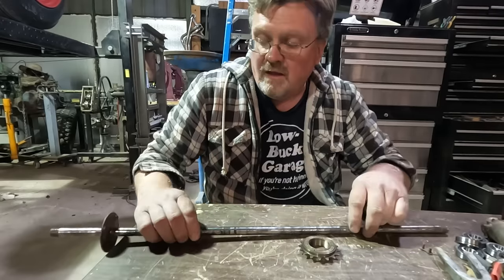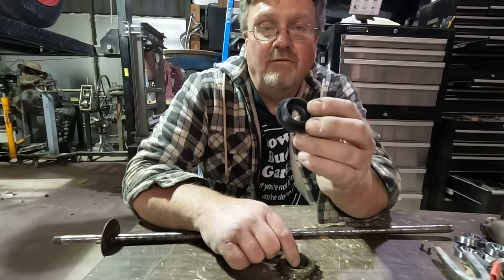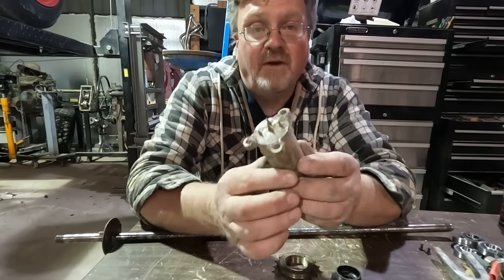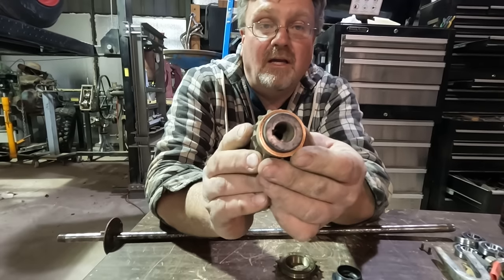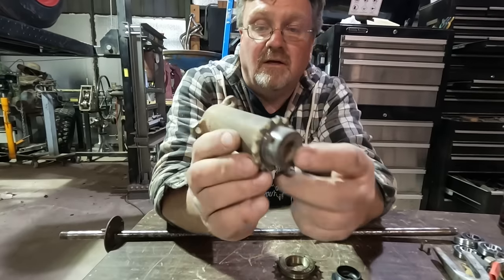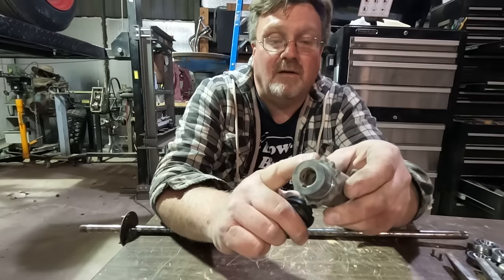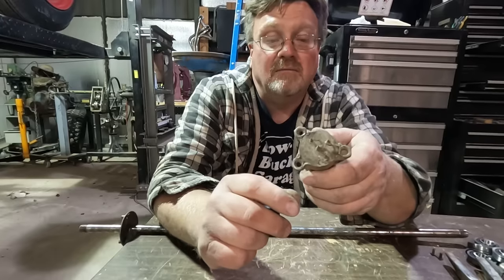Ready to start putting it back together. I've got the one-way sprocket from the electric motor kit and some kind of adapter they sent — I have no idea what it goes to; it's hollow and not very useful looking. I need to go to a 5/8-inch shaft, so I need to make something inside this that will drive off a keyway. Digging in my scrap bin I found a piece of tubing with a sprocket welded to the end, a bushing slid over that sprocket with a 5/8-inch hole and a keyway. The other end has sharp prongs and nuts welded to it — no idea what it did. I think I only really need the sprocket part, so I'll just slice that off.